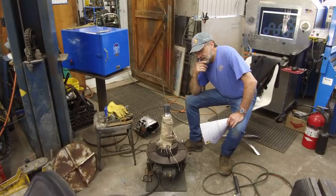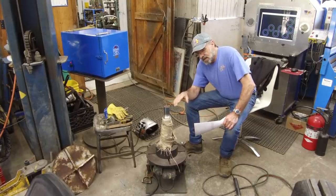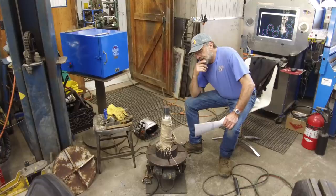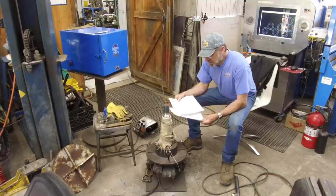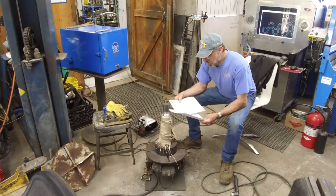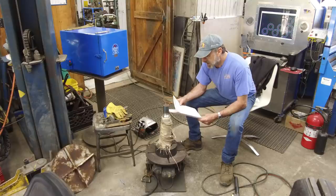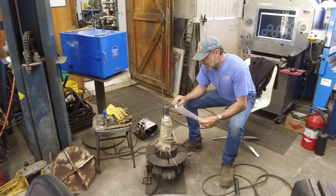that tells me that rod is not gonna work or mix with this alloy that the shaft is, and that kind of leads me to believe that this might be 86 series material. And that was why I chose what I said in the first video there, the 4130 LN rod, because it was 4130, 8630, and the likeness of those materials. And the 4340, which I tried on here, was just in the 40 series materials here.